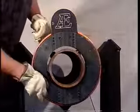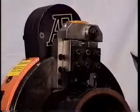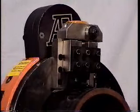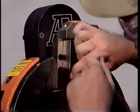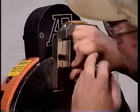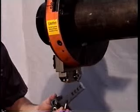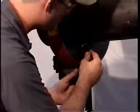Remove pins from the split frame. Tool slides are fastened to the split frame using 5/16 18 bolts about 1/2 inch long. Both tool slides should be installed to the same height. Slide should not be low enough to touch the pipe or higher than required. For our application, we will be using the 4-inch tool slide that is standard for the 6-inch split frame.